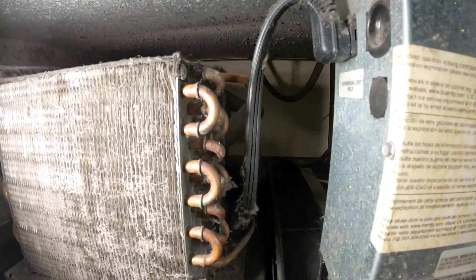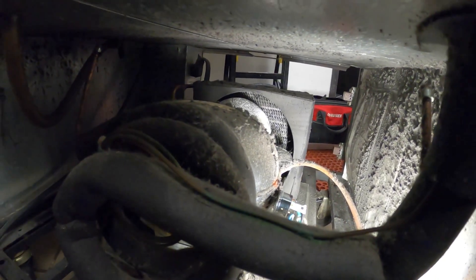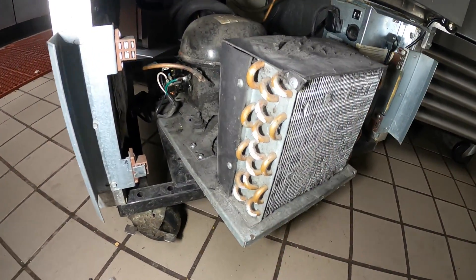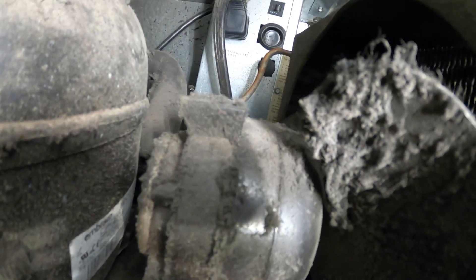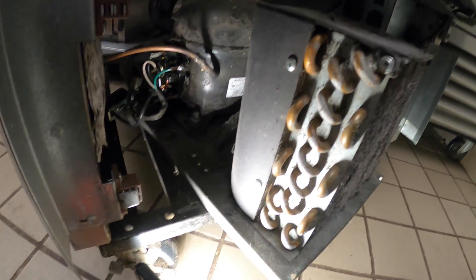I put my light on here — this is a very very strong light. Put it through the coil and you can't see anything. This coil is packed. We've got to clean this thing. I'd like to pull out that condenser fan motor and clean the coil from both sides. It's kind of a difficult spot to get into. I got much better leverage now. Look how dirty everything is — it's really really bad. Two screws there and two screws there. Let's see if we can get that off, clear out this area, and clean this thing up. The wire is so tight for that motor — I just moved it out of the way.